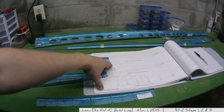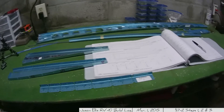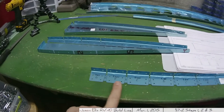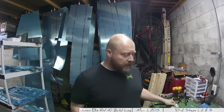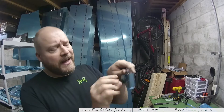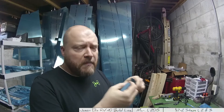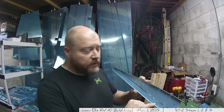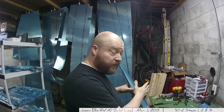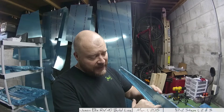Something I also did was mark each of the pieces that would become separate pieces accordingly. I tried using a pair of metal shears to make these cuts — it was a little awkward. Even with left and right shears, it bent the metal ever so slightly along the cut line. It wasn't drastic, really subtle, but I'd rather do this on the bandsaw and get a cleaner cut. Also, as you get farther inside the piece, the shears become much more difficult to use. Let's go cut.